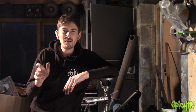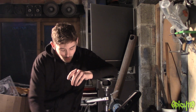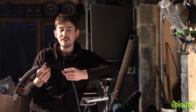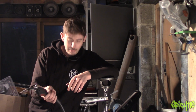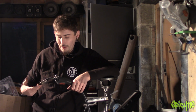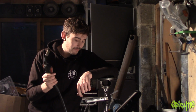The one thing about this machine is that the adjustments are not very incremental. The wire speed's a bit variable; you put it in one place one time and it's not quite the same the next time. I've also noticed, and I know this is true for all welding leads, that inside here you have the metal core that comes down. If you get too much of a kink or even a loose bend in it, especially if it's pushing uphill, it hasn't quite got the power. I've adjusted the wheels inside the grip so it's about the right strength.